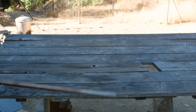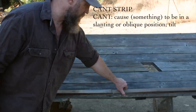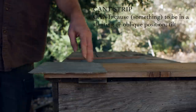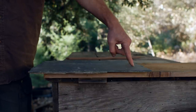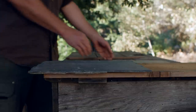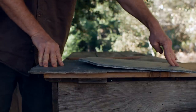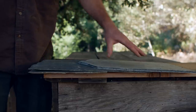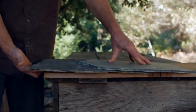I'm going to run through how this slate roofing system works. The first thing we need is cant strips - just some thin boards, maybe half inch, that raise the front edge of the slates. If we nail a full-length slate in place without a cant strip, we have a gap at the front or at the back. Either way there's a problem. Obviously the solution is to put in a cant strip.